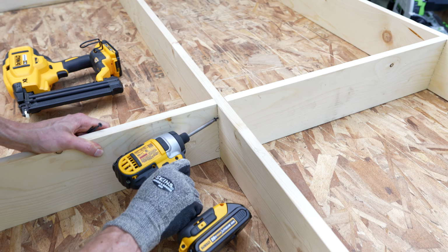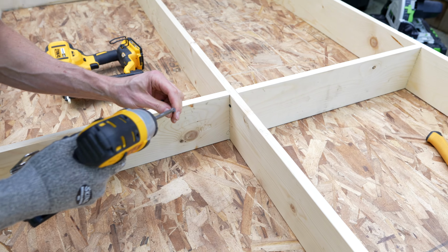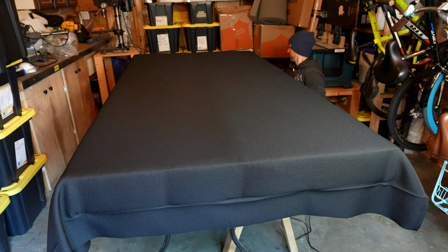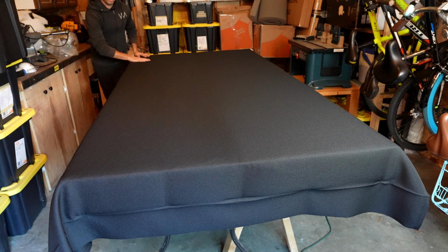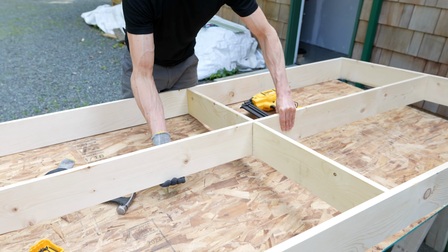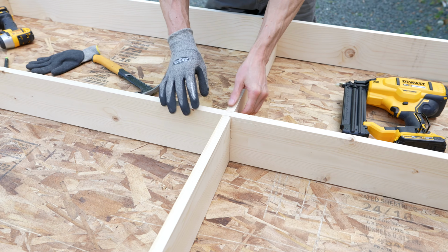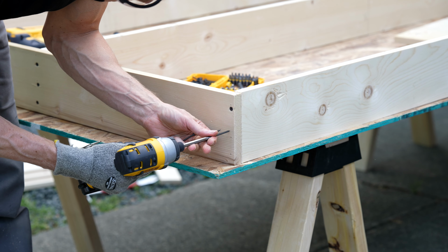And again, if you were seeing this frame, you would do this differently. You would use some type of joint or maybe pocket screws, but in this case, nobody's ever going to see this. It's going to be covered by Rockwool and wrapped, so just do it the quick way and toenail things in. The nice thing about toenailing things in is they're pretty forgiving. If you misalign something, you can just use a hammer and tap things into place so they're right in the sweet spot. I should mention that we're using 3 screws to secure each section of the frame.